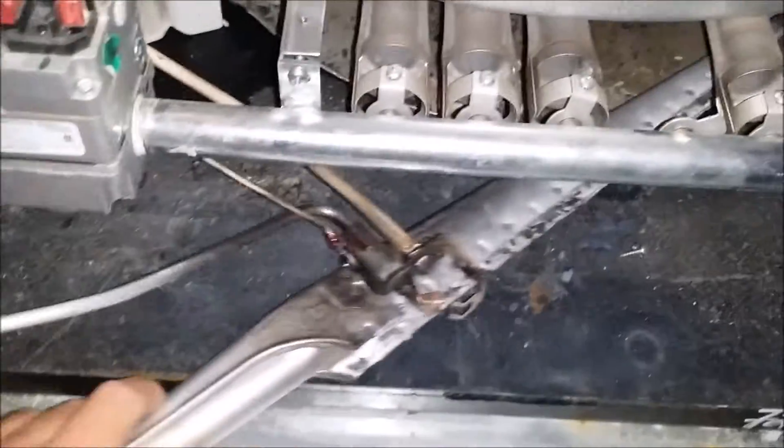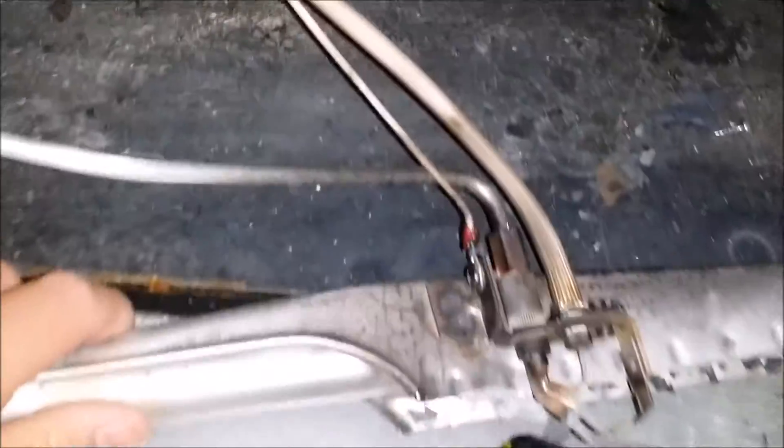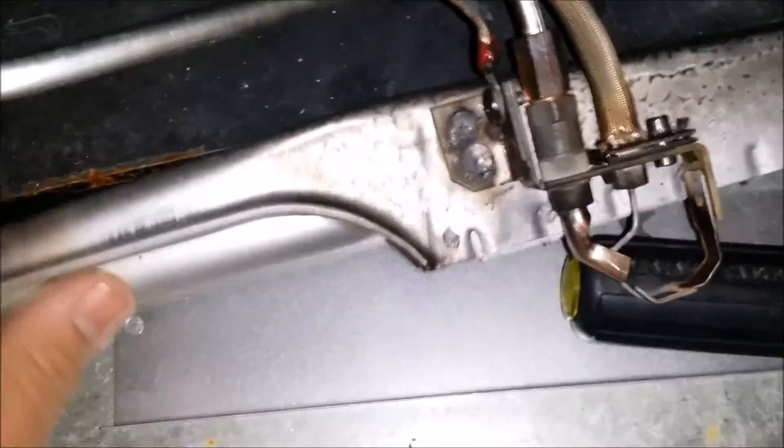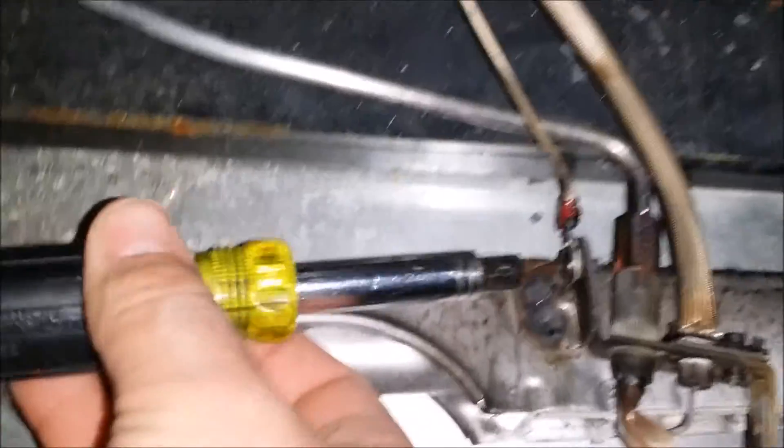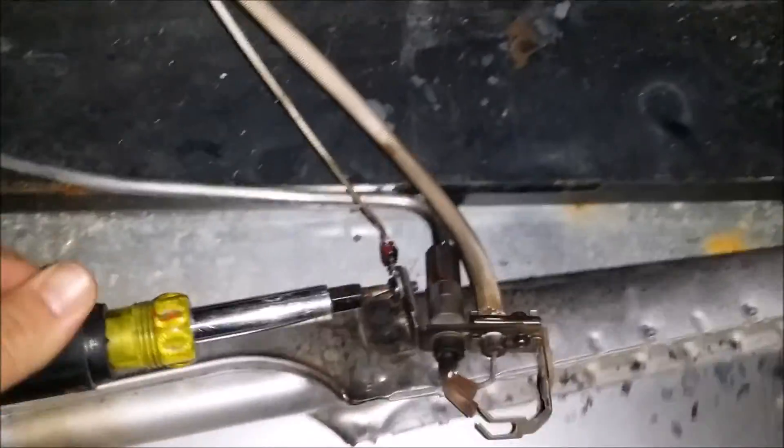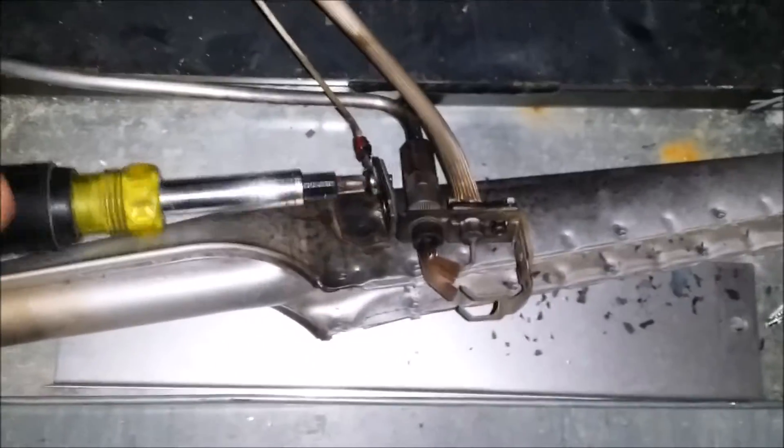You want to be gentle — you don't want to pull any wires out, especially your ground wire. So you see that's what we're going to change — that whole ignition. Remove the one screw which holds everything in place. Then once you get that screw out, you're just going to put the ground wire aside. Don't forget to put it back on when you're done.